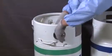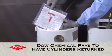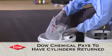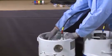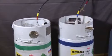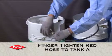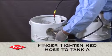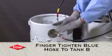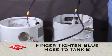Also, while over here on the A side or ISO side of the tank, there are shipping instructions for returning the cylinders. Dow Chemical pays to have the cylinders returned — you just fill out the paperwork and they can be given to a shipper. All the shipping information is included. Now let's hook up the chemical hoses — the red A hose with the other A lines attached. I like the ball valve left in the upward position. We're going to come back and tighten this all up with a couple of wrenches. B chemical over to the blue B side.